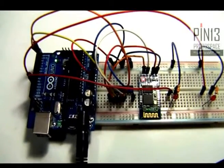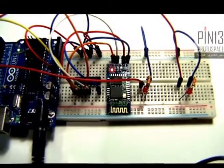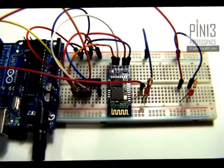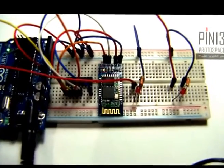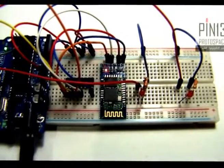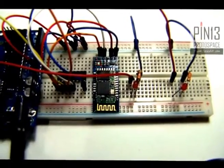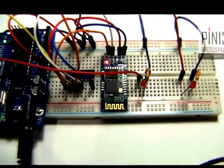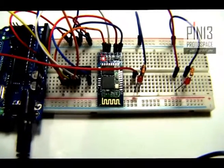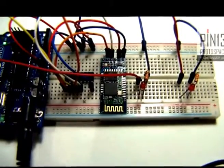Let me explain the test circuit I'm using. I have an Arduino Uno and the HC05 Bluetooth over serial module, which I bought from eBay for less than $10. There are two versions: one without a breakout board, which is a nightmare to use, and one with a breakout board for a couple of extra dollars — it comes with LEDs to indicate pairing status, current limiting resistors, and male header pins so you can mount it on a breadboard.